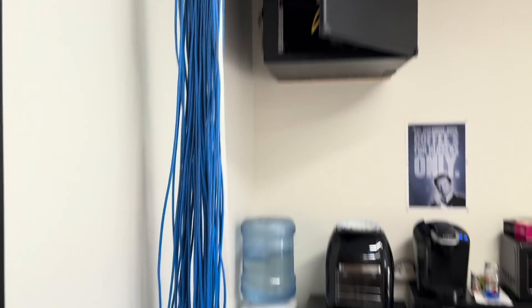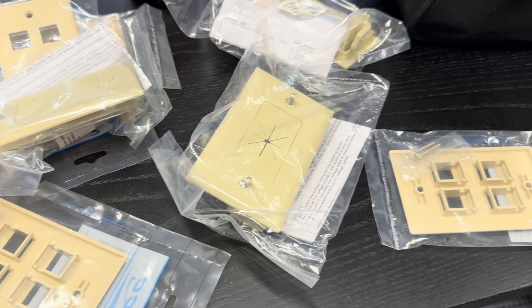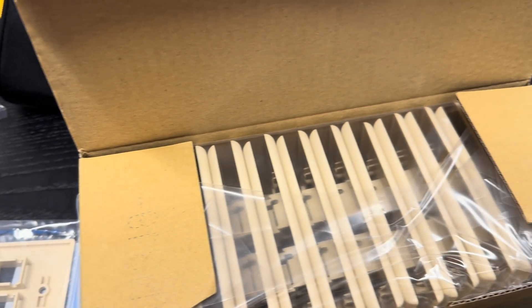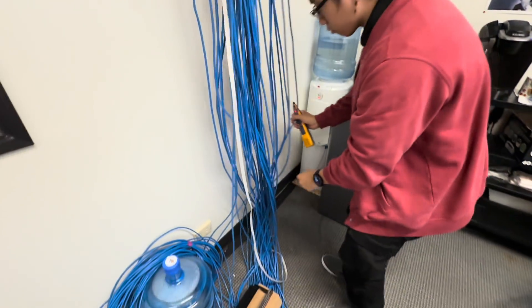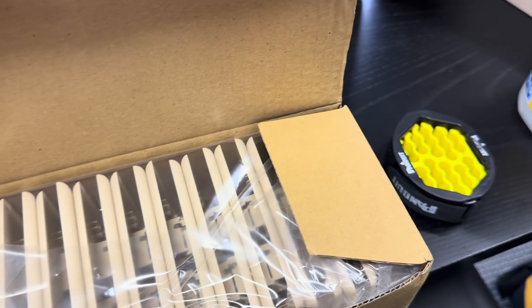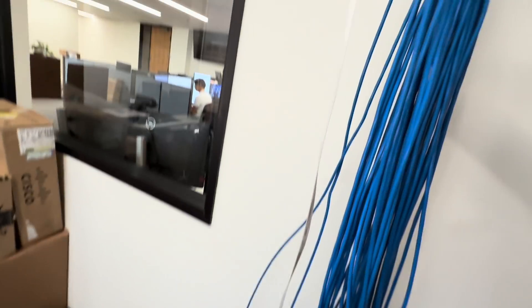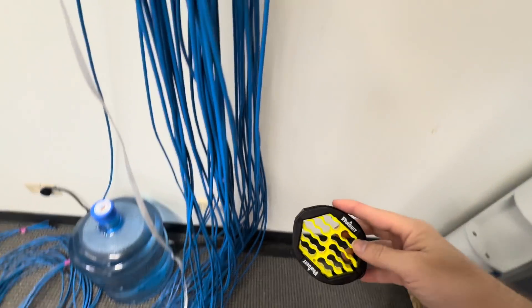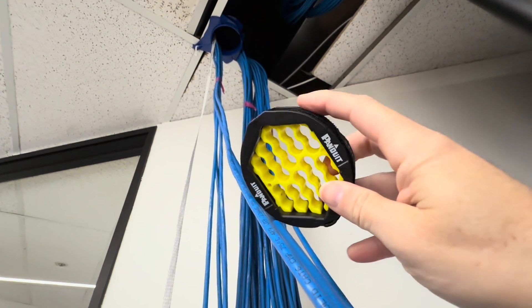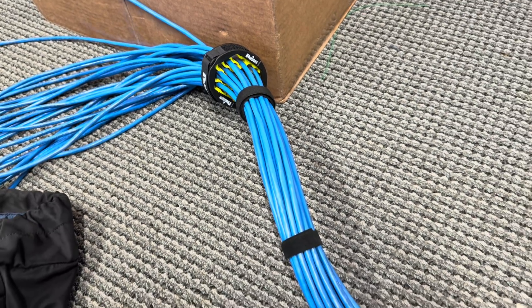The team has finished running all 50 wires, and they're right here hanging in front of the cabinet. We're going to be doing what I call finish work — that's the faceplates, the connectors, the labels, the testing, all of that — and then tightening up all of the slack, making sure we have service loops and the like. The first part I call roughing in, and we follow it up with finish work. Now the most visually pleasing part of the finish work happens with this little tool right here — this is the cable comb. All you got to do is thread all of your little lines into these honeycomb structures, then pull it down, which straightens out everything, and then you Velcro all of your cables nice and tight. I like to do them in groups of 24 so that they match a panel row. We're going to comb all of these out before they enter the cabinet, so the combing happens at the stingray, and then the entire bundle as one solid piece will be threaded into the rack.